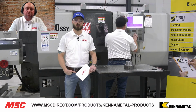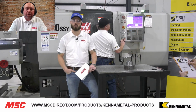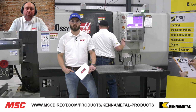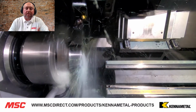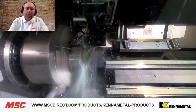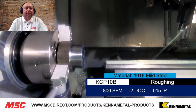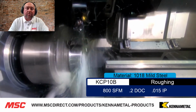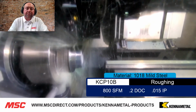So what we would do to optimize your machine and create that capacity is to get harder grade inserts, something with higher cobalt content, and really get after that. So what we would do here is use our KCP10B on our roughing in this step here, and also get a little more aggressive on your depth of cut. We're going to go 200 thousandths step to cut on the radial now, and then we're also going to increase our surface footage to 800 surface feet on the roughing, and feed a little bit faster at 15 thou inches per rev.